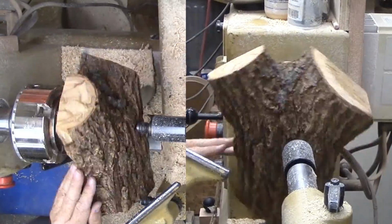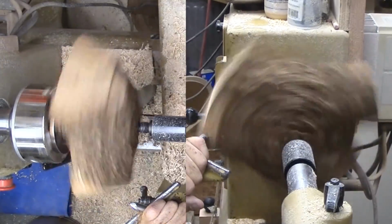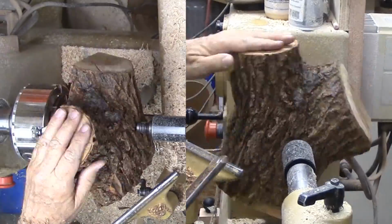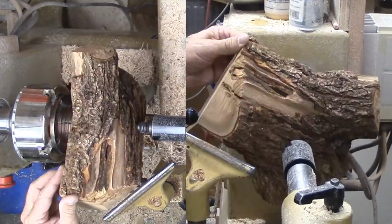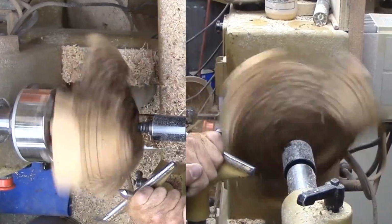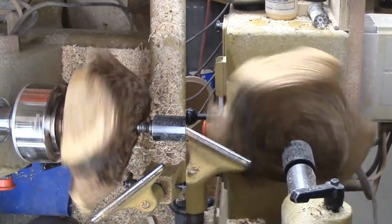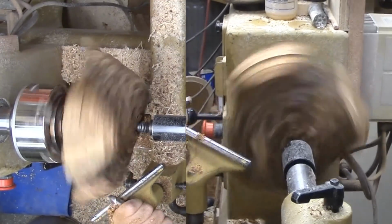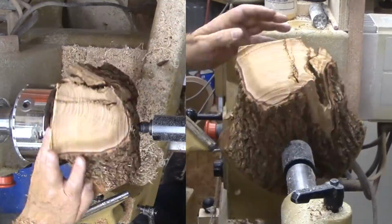This apricot crotch wood was cut about 7 years ago, ripped in half and waxed. It has been knocking around my shop for that long. It is absolutely dry, but has severe cracks. I've closed my chuck jaws tight, but pressed the flat side of the apricot against the face of the jaws with pressure from the live center. The wood is so unbalanced that I cannot turn my lathe speed up very far at all. The tool rest is at an angle to the bottom of the wood.